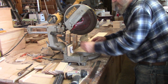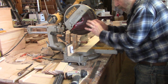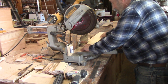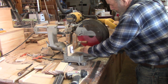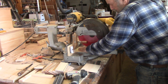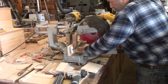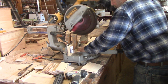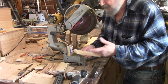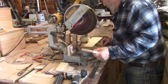And so clearly a similarity is the drawer bottoms. All of the drawer bottoms on this set of drawers are the same. That's 6 boxes, 6 drawer bottoms, all exactly the same. So I've got a stop set up, and the stock is already ripped and 3/16 of an inch thick and sanded, and here we go. And I need a couple of these, so why not get it done? I've already made 3 of them warming up for this, because I wanted you to see it go without any grievous errors or great mistakes. So you get the benefit of not having to sit through all of them.